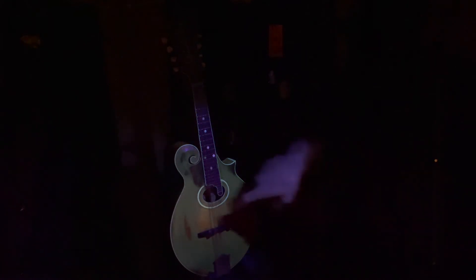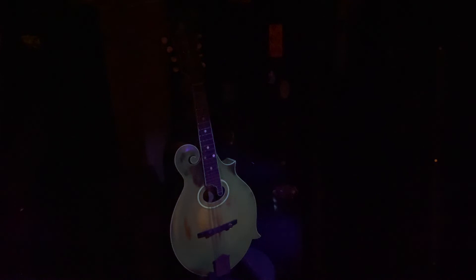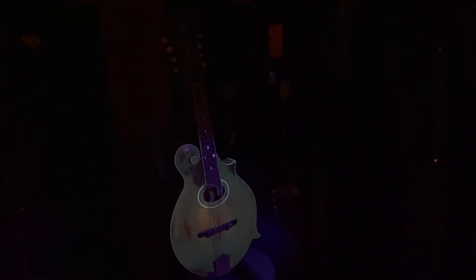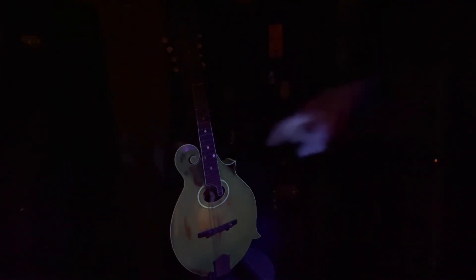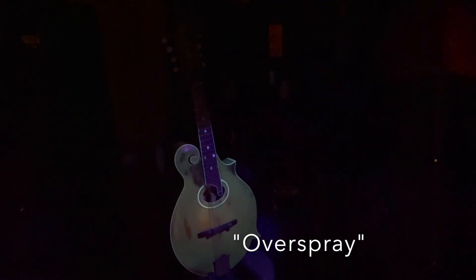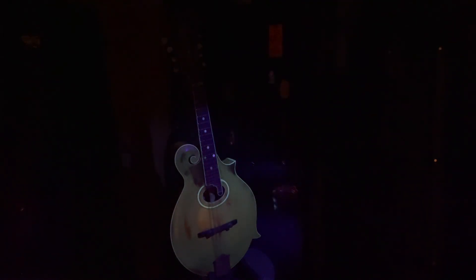The next area is right here where it's just a really light, faint disruption. It doesn't fluoresce in the same way. If it's wear like here and here, then it's just the wear of the finish. But in this spot, as you saw before, it looked like it was glossy and like the finish was pristine there. So this is more than likely overspray. And in fact, when you really examine it with your naked eye, you can see that there's some glossier finish there. But under the blacklight, it shows up immediately.